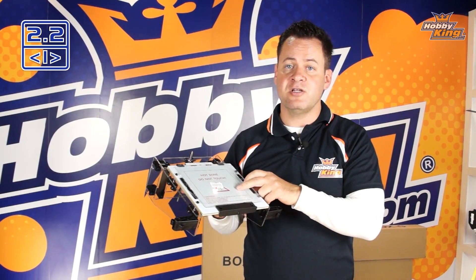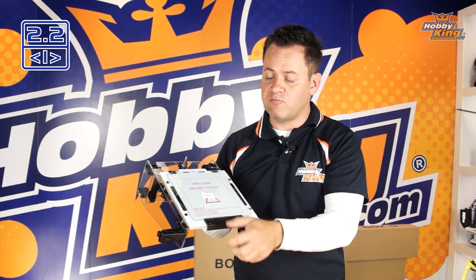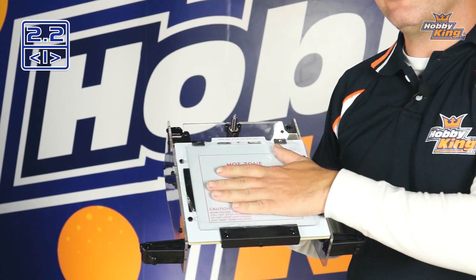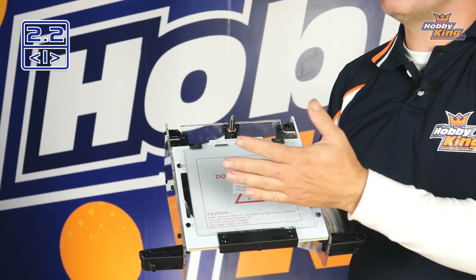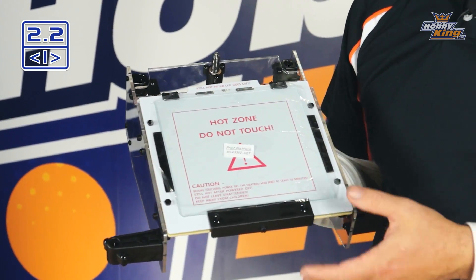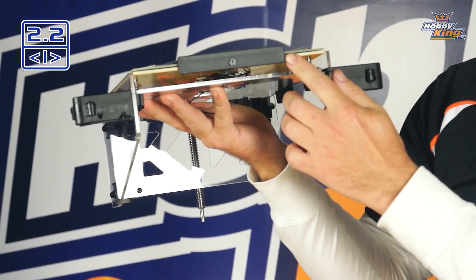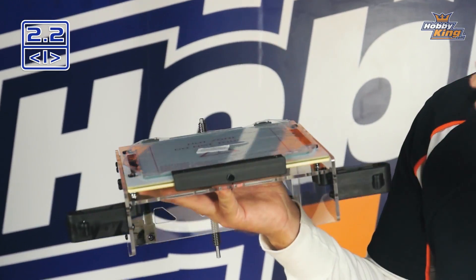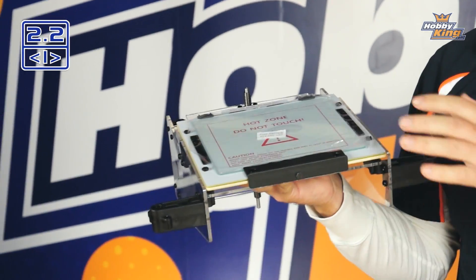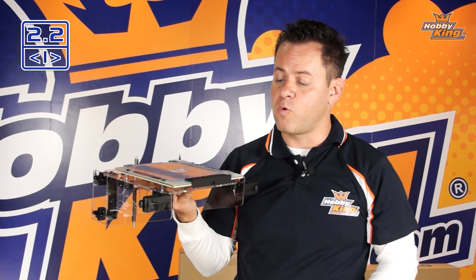To deal with that warping, there are two things on this platform. There's a piece of glass on top that is quickly removable, so you can hot swap multiple print platforms. Some could have Kapton tape for ABS; some could be coated with hairspray for PLA adhesion. There's also a phenolic piece of material in between with an air gap, which helps stabilize temperature, requires less amperage to maintain it, and provides mechanical support to stop warping.